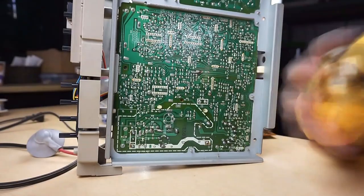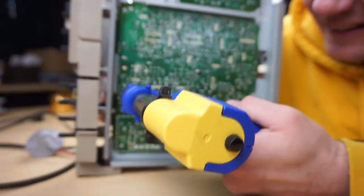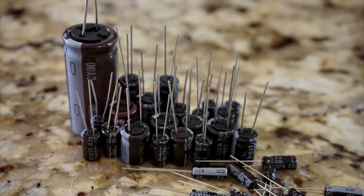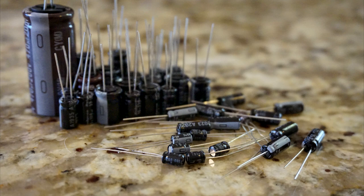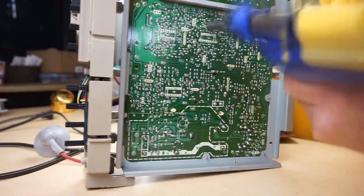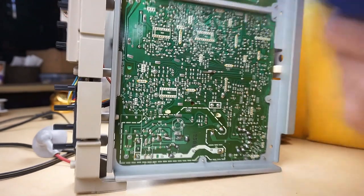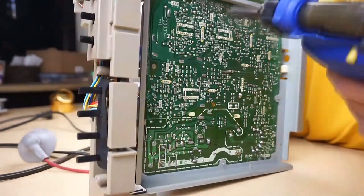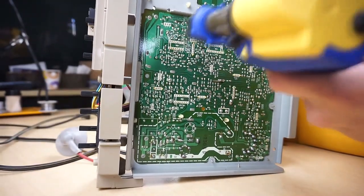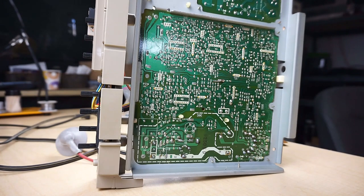And as I upgrade our capacitors, the ones we're going to be using today are going to be Nichicon brand. This is one of the top, I'd say, 3 or 4 brands. Other brands you could try out are Rubycon. I've had very good success with Rubycon replacement capacitors. And again, we're going to jump up to the 105 degree Celsius rating. And then we're going to maybe jump up a little bit on some of the voltage for a couple capacitors if we need to consolidate an order where we don't want to order just one specific, say, 16 volt, 10 microfarad capacitor, where we can order 25 volt capacitors if we have to use them in other places on the board.